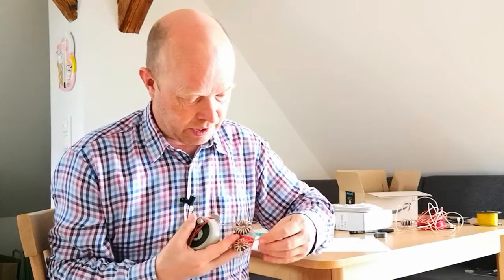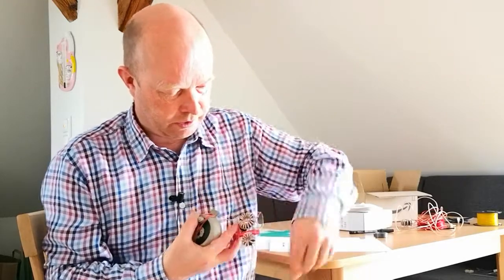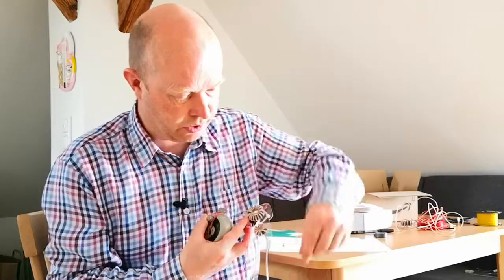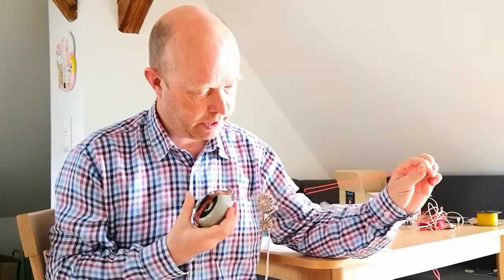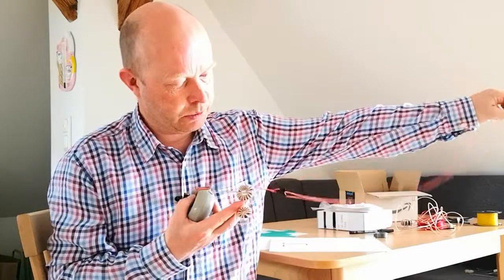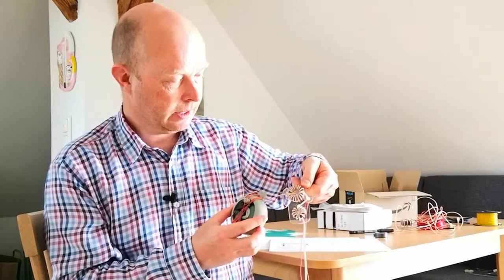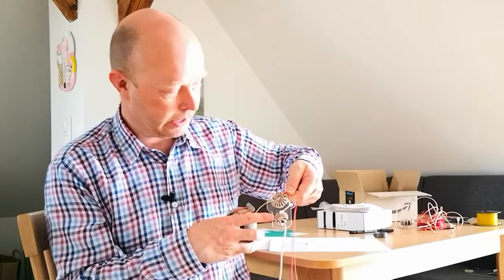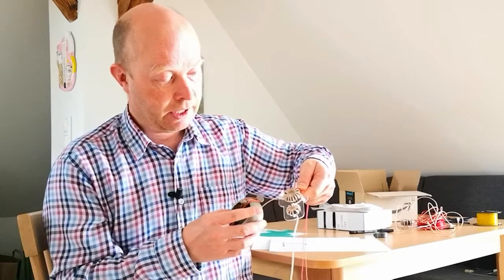And this is the antenna that I use every day, my everyday SOTA antenna with the KX2. I'll unwind some of the line here so you can get a better look. Now you can see I've managed to reduce the size of the ferrites. They're both type 43, and that would normally go in a tree somewhere and hold it, and then the rest of the antenna is all on this really handy washing line reel, a camping washing line reel from Gellert. And so ferrite here, I believe it's an FT114 43, and that I believe is an FT82 43, and I find that's okay.